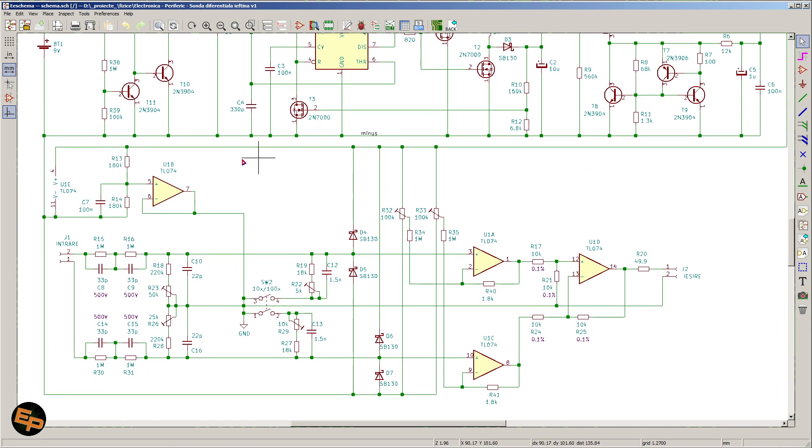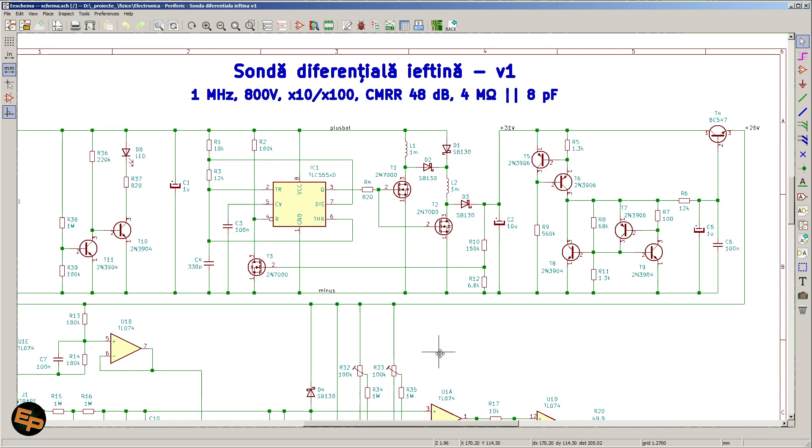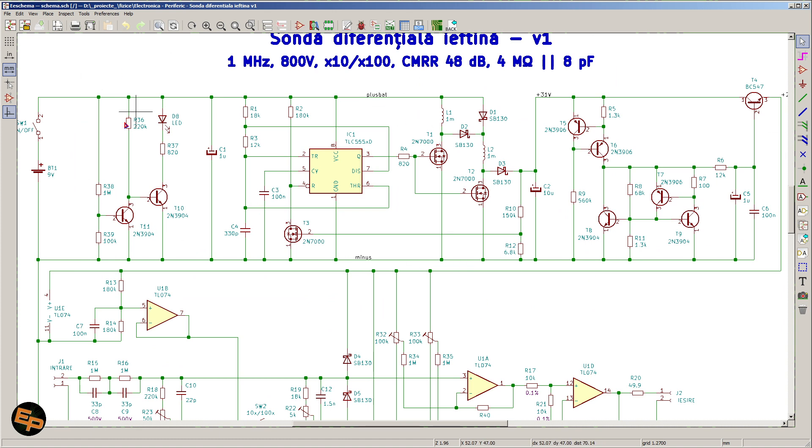I am taking this relatively constant voltage provided by this pseudo-Zener diode and further filtering it with R6 and C5-C6 — an RC filter essentially. This voltage gets fed into the base of T4, which acts like a pass transistor that on its emitter relative to ground provides 26 V that we then use to feed the rest of the circuit. So basically the upper half of this entire circuit is just the power supply that is able to take the 9 V from the 9 V battery — which can get down to 6 V — and give us 26 V constantly on the output.